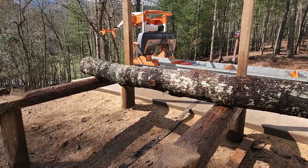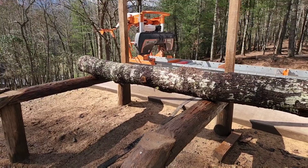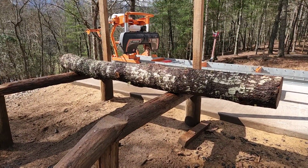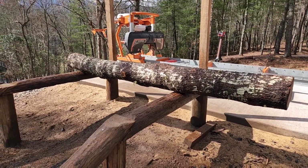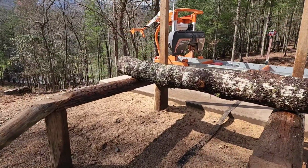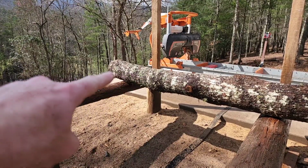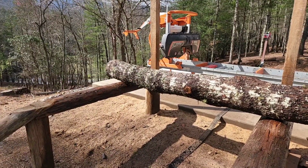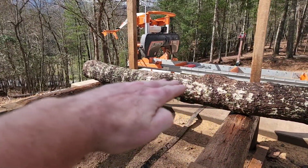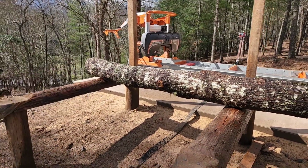Plus you're going to put almost like a ridge board or a ridge beam across the opening. So it's going to actually be a little higher than that once the purlins get on and all that other stuff. So 8 feet will definitely work for me. I'd rather concentrate on getting that out of that 8 feet than having to deal with this little bend at the end. So ideally, I'd come across level across most of it and then take a really big chunk out of the end. That might have to happen.